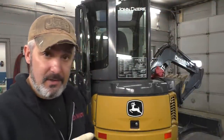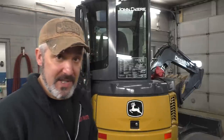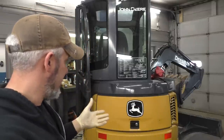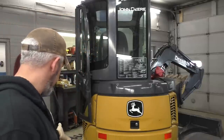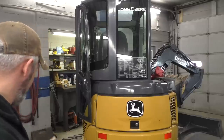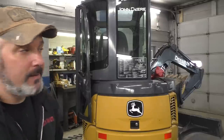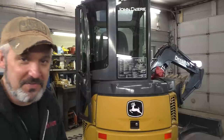Hydraulic fluid, your suction filter, the main hydraulic filter, plus the pilot filter and the engine coolant. That's what we did in this video. All pretty easy. I'm gonna go out and work it again to get any of the air out of the pilot system. Double check our fluid, but it was minimal what we lost. Maybe a few ounces, maybe 10 ounces, something like that. Not even that, probably, whatever. So we'll just double check it.